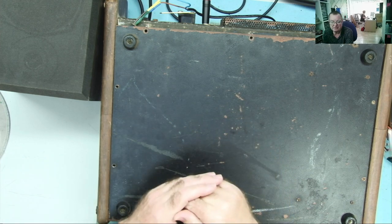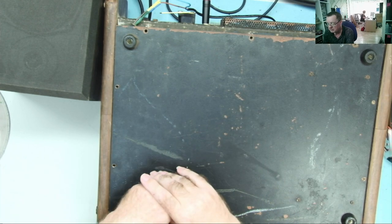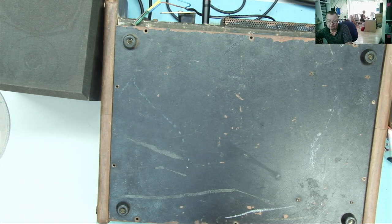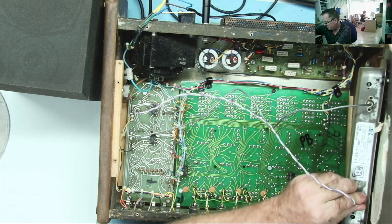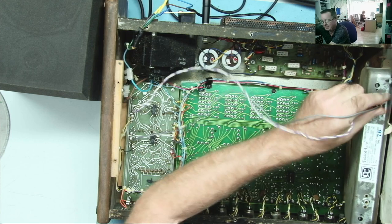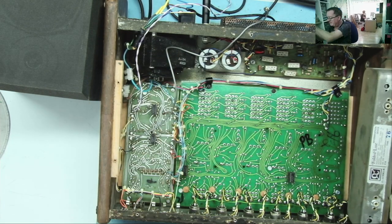And that again makes me think capacitors on the voltage rails and probably on the mixer. We pretty much proved the fault is on the mixer board. So what I'm going to do now is actually remove that PCB. While I was doing this, by the way, I also reconnected the echo box thing, and I checked in the schematic, which doesn't really properly match this, but I think it's very similar, and I made sure it is the right way round in and out, which it is.